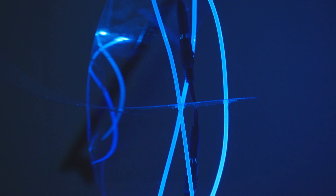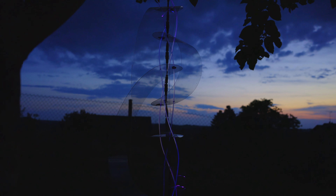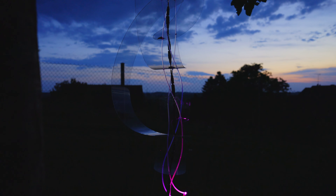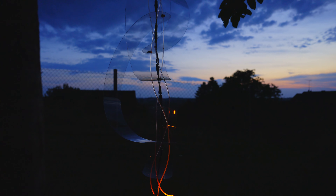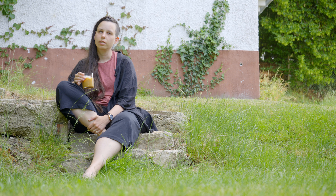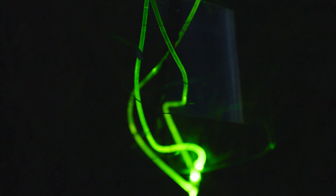Overall I'm really happy with how the prototype turned out, though there are a few minor issues to figure out — maybe with Aska's help. The big modules' foil is slightly too thin. There are multiple solutions: Aska might have a thicker foil overall, or they can choose a thicker foil for me. Also, as they already mentioned, the point where I solder the cables is the weak point, since all the weight lies on those two solder points. Some sort of reinforcement is definitely needed.